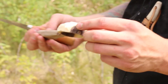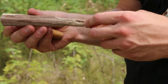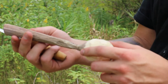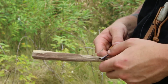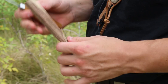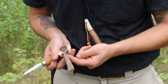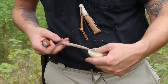We're getting really close to our final form here, just getting rid of a lot of the high spots and taking the handle down. I noticed this bug trail goes right through the handle — I didn't know that it went all the way through, but I'm just going to assume it probably goes out the back because I do see a bit of a hole back here. So this handle is going to be a little bit thin. Let me go ahead and thin this out a bit and see if I can get through that bug trail. We were able to save this handle — the bug trail moved around the handle, so I removed all of that, and we ended up with a really thin handle, but I think it will hold up fine.